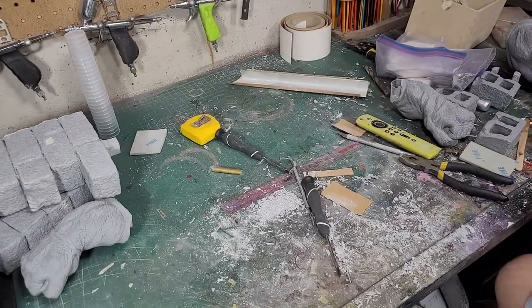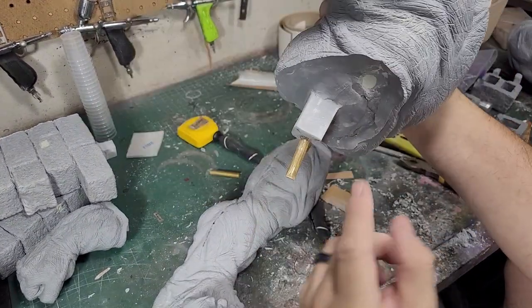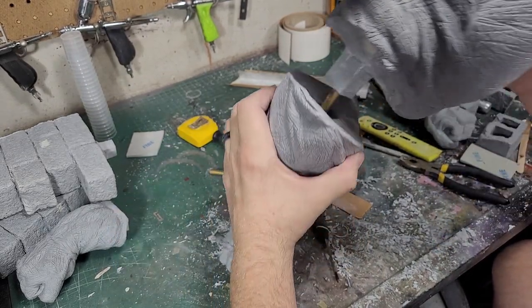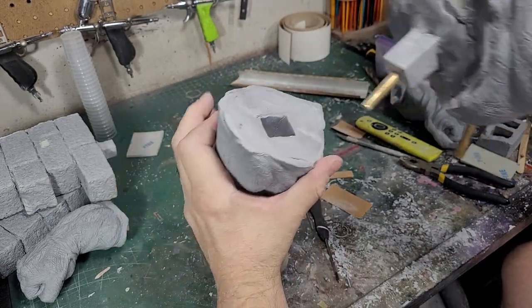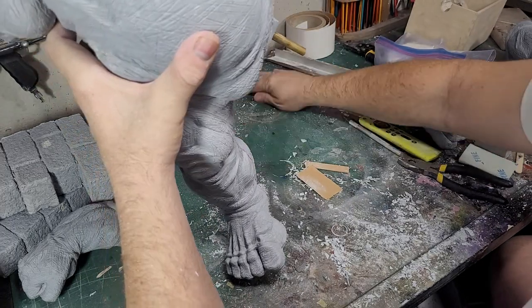Okay, so I finally figured out what's going on. It was the brass. If you look at the key, this key's kicking forward a little bit, so I just had to make the hole bigger, and now it fits in there fine. I got a big hole, but I'll just fill the hole with epoxy and we'll put it on the base and do that. So let's do that real quick.